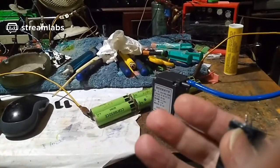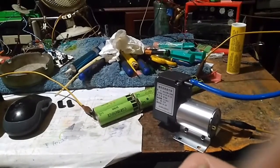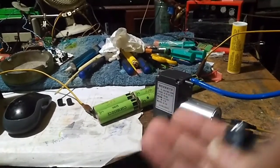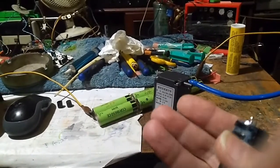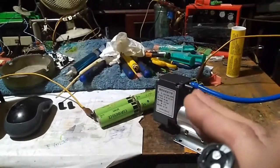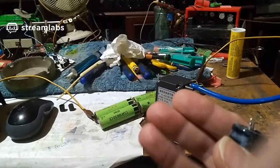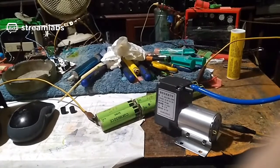So I had a voltage regulator on the robot vacuum cleaner, and what happened was the charging circuit on the robot vacuum would continually send voltage to the battery even though it was fully charged, and it said on the robot vacuum cleaner full, right? It said full, but after about 6-7 hours it was still trickling voltage in, so the batteries were actually getting slightly overcharged, right?